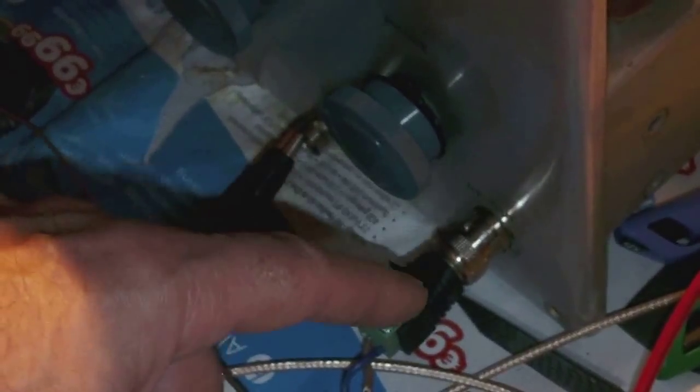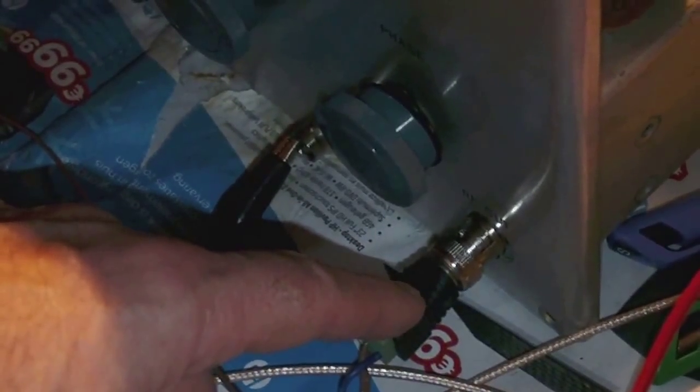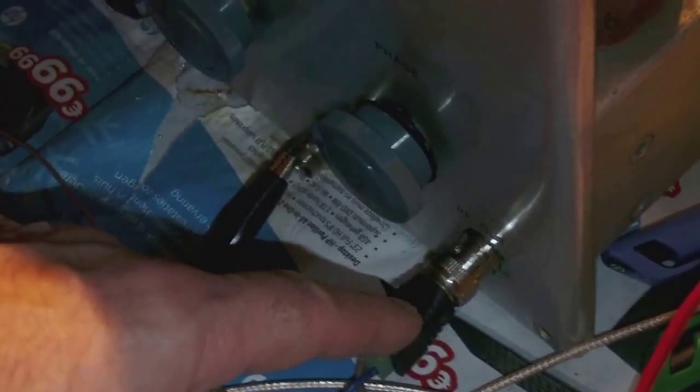Also, like I said a few minutes ago, the little adapter I built in on my attenuated RF output is wired as a demodulator right now. But if I want to use my sweep generator as an actual sweep generator, I need to disable the two diodes on that little module. So I need to do that as well.